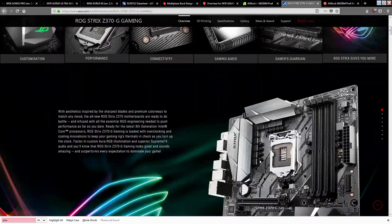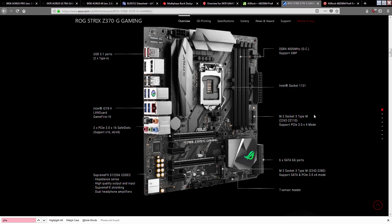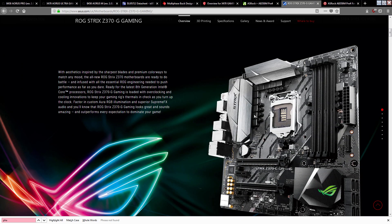ASUS has motherboards that totally look like they're an 8 plus 2 phase, but they're a 4 plus 2 with no mention of how many phases they have. I don't have a problem with that because they're not straight-up lying. They're implying there's more phases than there really are, which is a trap for inexperienced reviewers and consumers, but I don't fundamentally see a problem since they're not explicitly lying. Reviewers should definitely be aware that sticking more inductors on the output does not make more phases.